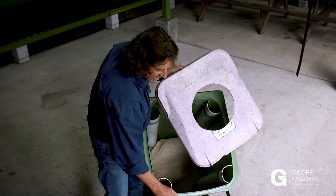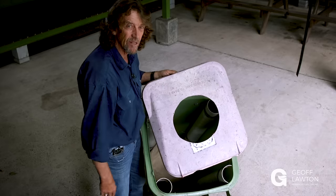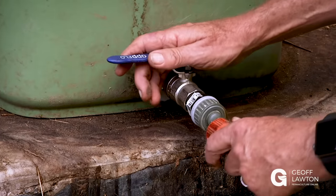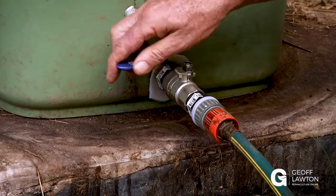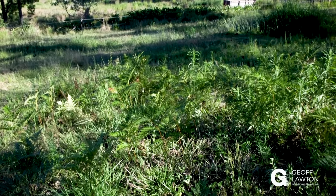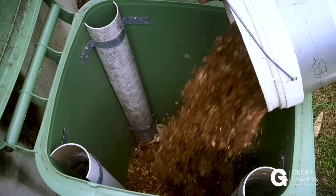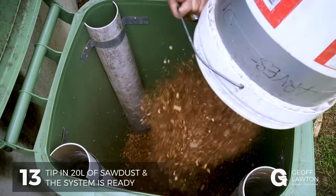The lid that's attached to the bin is going to lock it down when it's full so it can go through a full moldering process. We just click on the garden hose and open the tap, and any surplus liquid can be directed to a reed bed if you have one. Otherwise it can go to a gravel trench in the ground with a slotted pipe so all the surplus liquid soaks into the ground and becomes a natural fertilizer. All we need to do now is tip in 20 litres of sawdust — and we're ready to start the system.